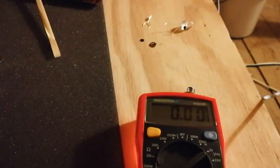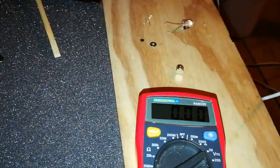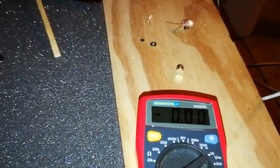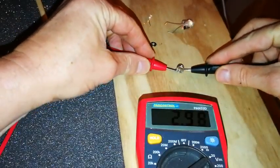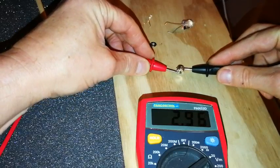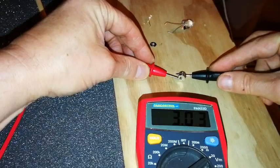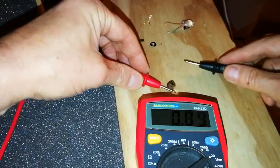There you go. So how much voltage is coming out of this? Put it in there, move the multimeter so you can see it. I'll just put the light on. I'm not really sure whether this is plus or minus — there you go. I would say I got three volts there, or a fraction under. 2.9 in fact — 3.3 volts, 3.4. So 3.4 volts out of six half-millimetre magnets, a bit of paper, and a bit of copper.